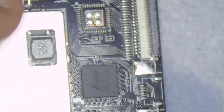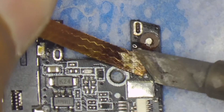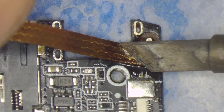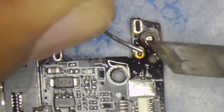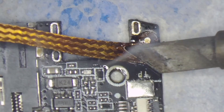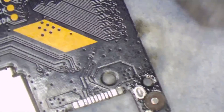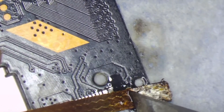Like I said, the more you clean the easier it will be — this is more like professional work. You can tell a good technician by how much they clean. That's a tip for you guys: clean! Especially with flux — the more you use, the more it burns and becomes darker, making it hard to keep your solder there. But if you clean, you'll have a fresh space to put your new solder.